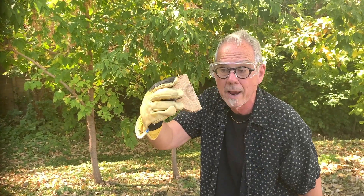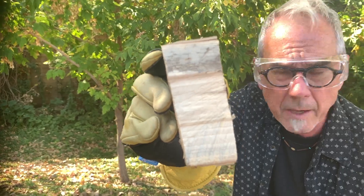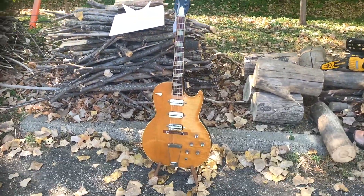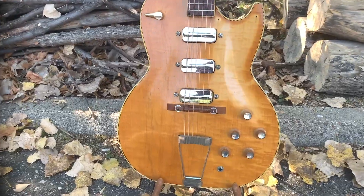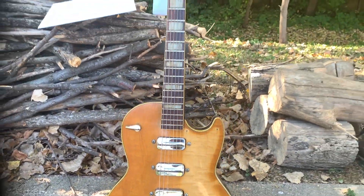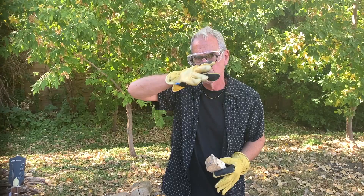The grain you get is a different grain. It's stronger. It's more beautiful. And if you look at that guitar, you can see some of the results of quarter sawn — there's this delicious grain in here. And that's why people do it: it's for strength, it's for beauty. If you look at furniture, you can see those beautiful rays in there.